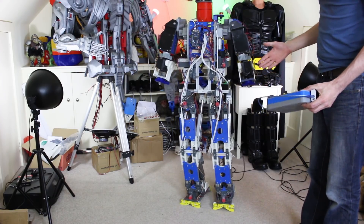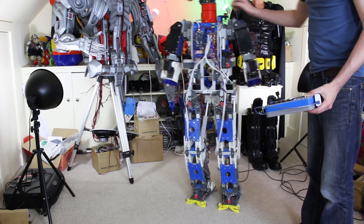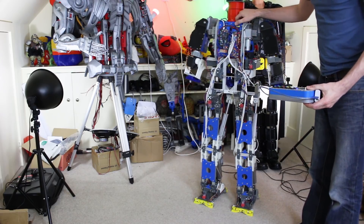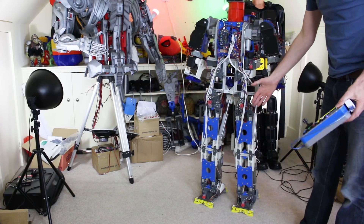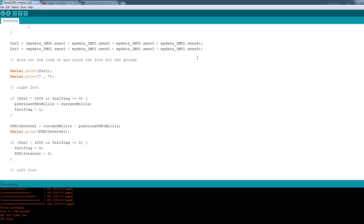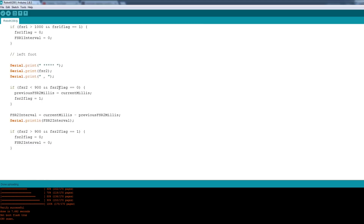It's just using timing right now — it's not using the foot sensors yet, so it's doing what it was doing before I had the foot sensors at all. It sometimes loses it because it's just using a bit of inertial measurement unit to work out roughly where the center point is to take the next step, but it doesn't know if its feet are on the ground or not. I've written some code now which basically tells me how long each foot has been on the ground. I've added up all those foot sensors for each foot and written a little algorithm that resets the clock as the foot hits the ground, tells me what the interval is since the last reset, and if it comes off the ground, sets a flag so it can't get reset. I've done that for the left and right foot.